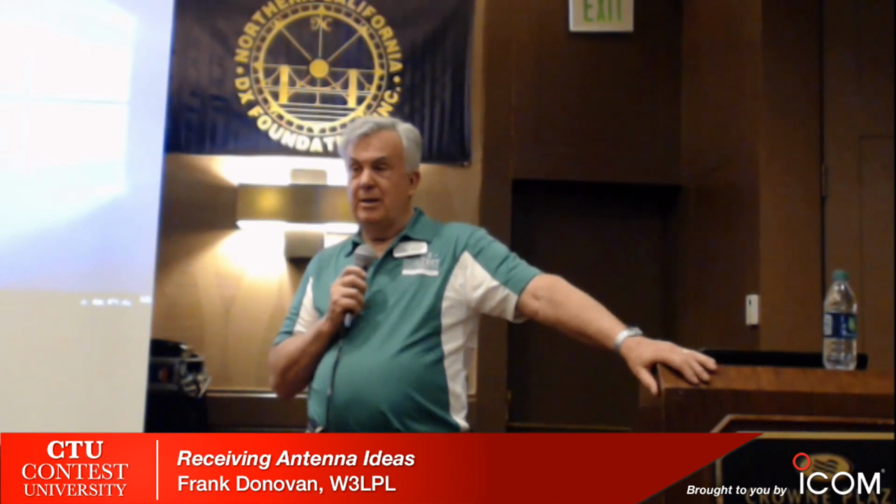properly. On the other hand, the so-called broadside end fire array with passive elements, so that's a 3-acre array, is very simple. It's large, but it's a very simple array. There's no electronics in that array. Of course, there are relays to switch directions, but that's very simple electronics. There's no electronics at the base of each element. So the performance of the passive array is no better, no worse, but the reliability is far superior because of its simplicity.